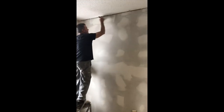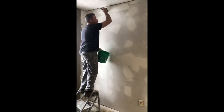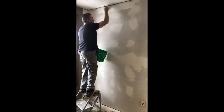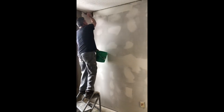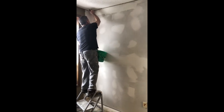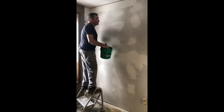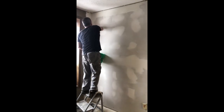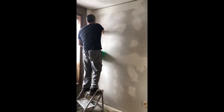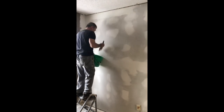See how fast you can put on paint with a four-inch? By just slapping it on, it holds a lot of paint. You can even cut with four inches. A lot of the pros always use four-inch brushes, even for cutting corners, because it'll carry more paint and you have to go back to your bucket less. Use the biggest brush you can handle — don't use the smallest because it's hard to work with and it's going to take you a lot longer.